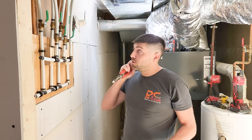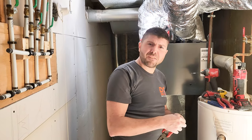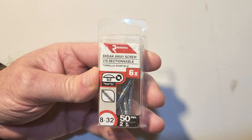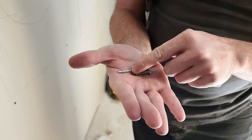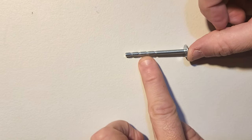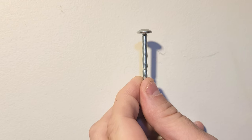Ironically enough, after talking about 832s and 632s, my 832s were too short — I need them about a half inch longer. I couldn't find any bolts that fit, so we got our breakaway bolts here. They're 832s and these ones come up to two inches long. This is our original length and we're probably going to break it off at the second last breaking point. Here's the breakaway bolt: one inch, one and a quarter, one and a half, one and three quarters. What I need is one and a quarter, so I need to break off three of these points.